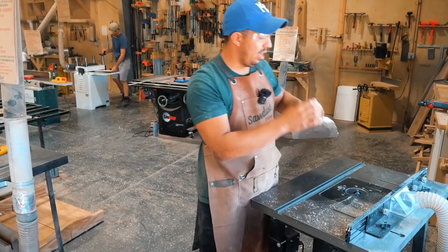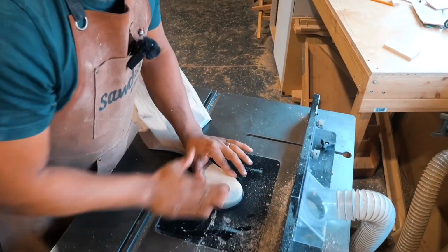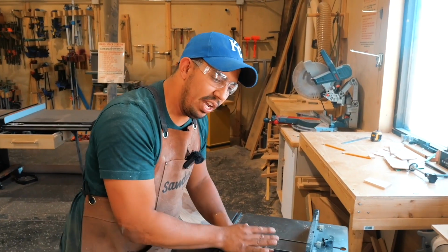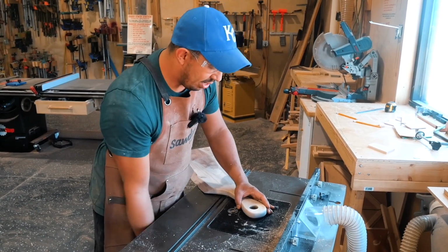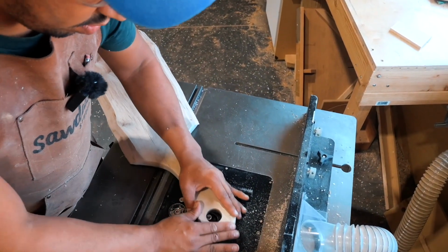And for this, I'm gonna set my hole over the router bit, rotate counterclockwise. That bit's spinning the other way, and even if you tell your brain to go this way, it's gonna try to go the other way. So I like people to practice beforehand, go counterclockwise, counterclockwise, counterclockwise, okay? So when I turn this on, I make contact and go fast, okay?